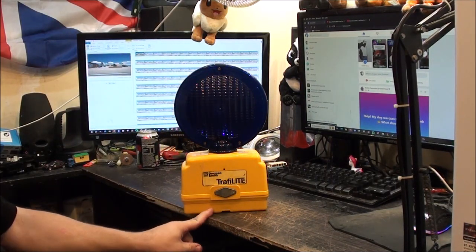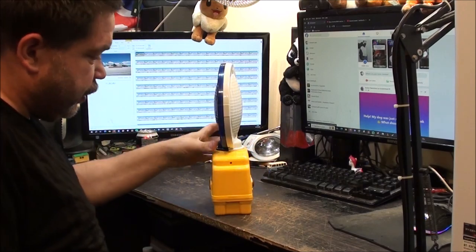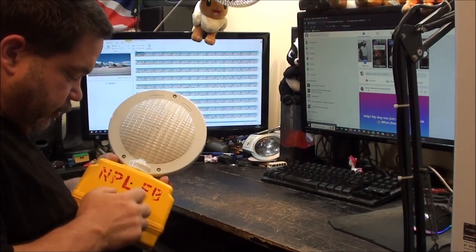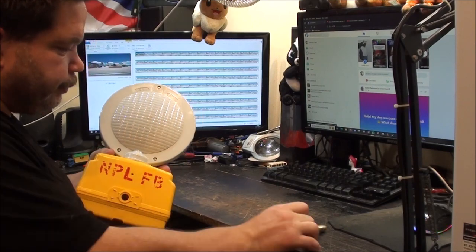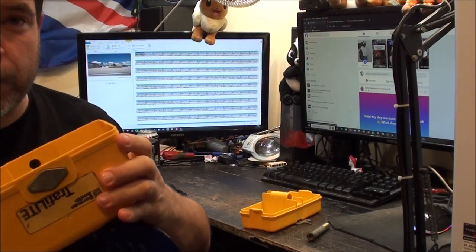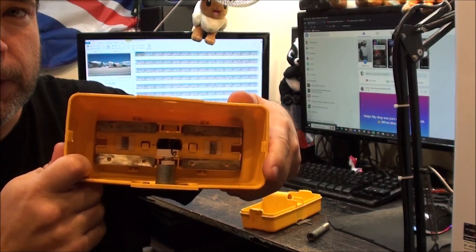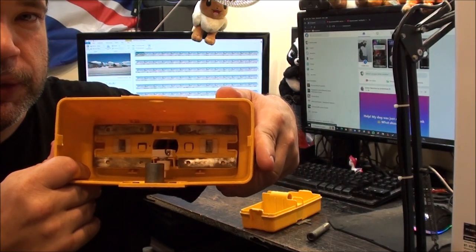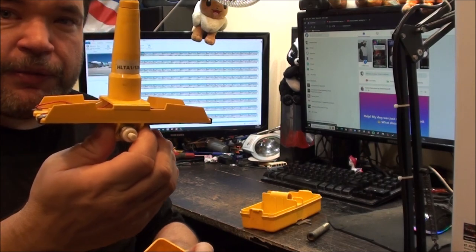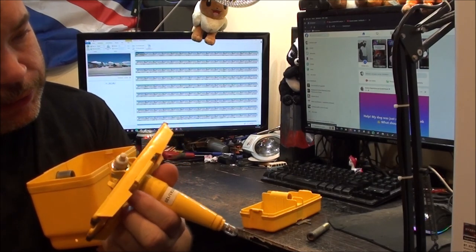And plus, the date code in this battery tray is actually 1986, which is probably the biggest giveaway that it's a really early version. The circuit is also an early version of this particular type of circuit. It's almost identical to the modern ones, but these longer brass contacts are actually wider than the later version of the highlight circuit. These are quite broad. Other than that, they didn't really change much, just the contacts. Like I said, these are narrower on the newer version.